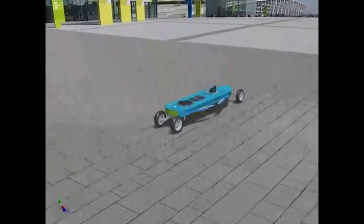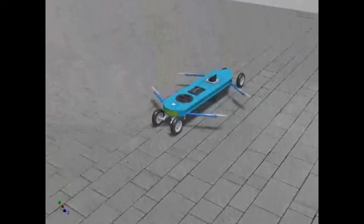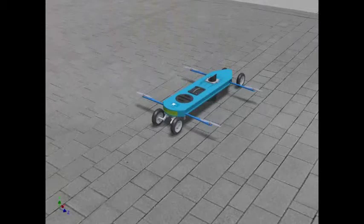The first involved the impeller assembly, which would shoot water directly into the rear suspension assembly based on the initial design. To solve this, a small hump was added to lower the impeller below the board further. Other issues I encountered included interference between the steering assembly and the impeller, and problems with components below the board that would likely scrape the ground. Anytime I ran into issues such as this, I had to contact the team member responsible for the respective part and work with them to make the necessary changes, and then update the system accordingly.